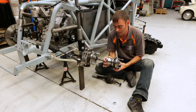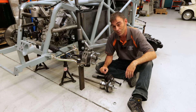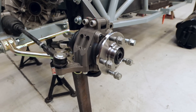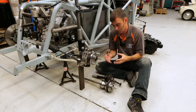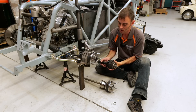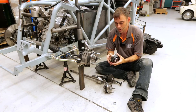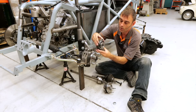The problem is that was designed for a Golf Mark II, and now we're going to be putting around 600 horsepower through that drive shaft — and that hub and everything else simply isn't up to the job. So we had a challenge: we want to keep these lovely strong billet aluminium hub carriers, but how do we go to something that can cope with the power? Luckily, in the VW-Audi range there are cars like the Audi R8 and the Audi RS6 which are fairly similar. It's all about the bearing — a bearing inside a bearing carrier that sits on the hub carrier. We needed something with a bigger internal diameter to fit a bigger CV and hub.